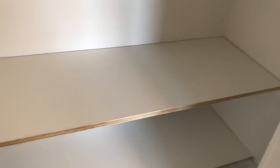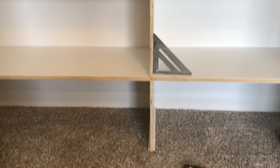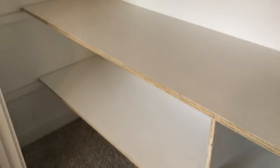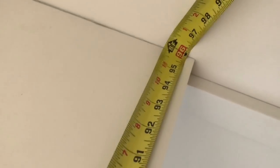I cut my upper shelf and lower that one into place. Now we need a divider for this one too. I measure at the perimeter because you want a consistent height all the way across the profile of the piece — getting a little shorter here, something like 15 and a quarter. Cut that one, put a notch at the top, and first just line it up by eye with the lower divider, using my speed square to keep it plumbed up. I put a couple feet on this one too — I just put them on in place, pushing them into my glue. You could also use a three-quarter-inch divider and toenail it from the top and bottom. Those are shot on and shot down into the lower shelf and pinned from the upper shelf.